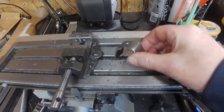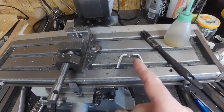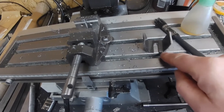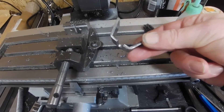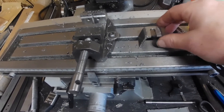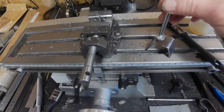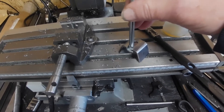So there's my little bracket, almost completed. I put some score lines down the inside with the disc cutter so it would bend nicely, and I think I'll just put a spot of weld in each end so it doesn't fracture — that's gone about halfway through. Just to get a nice clean bend really. I did actually make it slightly bigger than 8.5mm, so hopefully when the powder coat goes on that will allow for the coating thickness and it should slide in there nicely.